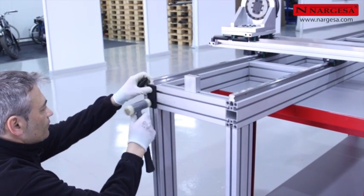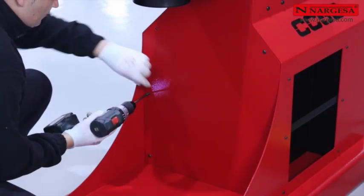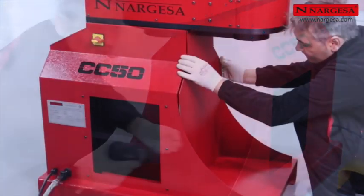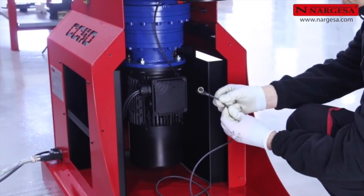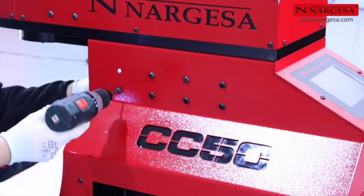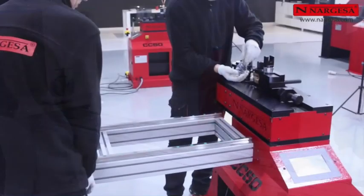For the CC60 model, remove the rear cover to more easily attach the limit. Insert the anti-collision inductive sensor wire above the side shelving, then unscrew the allen bolts one by one. Bring the stopper device close to the machine, move the heads towards the back to prevent extra weight, and fix them together.